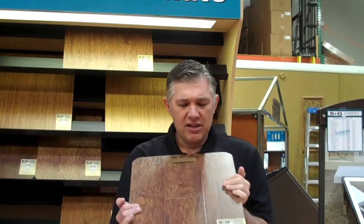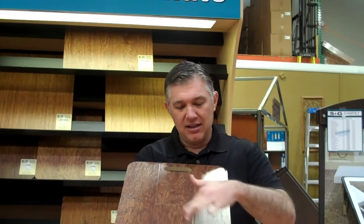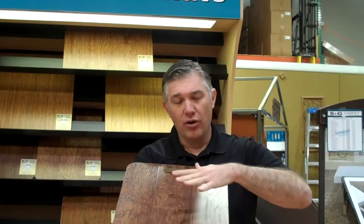The reason why a pressed edge has become popular is it doesn't have a groove. Some ladies and some gentlemen in their homes, if there's a pebble or a rock, bevels are good in that if there's a pebble on the floor, or if you step on it, it could possibly leave a mark in the finish. It'll fall into the groove and keep damage off of the floor. That's usually what bevels are for. They also help define each board.